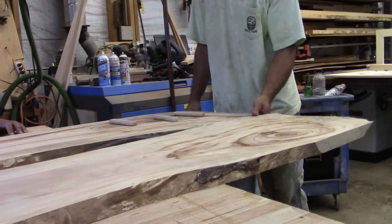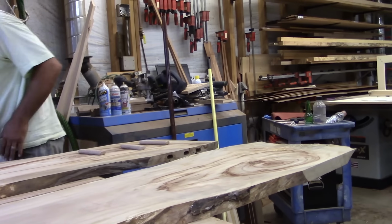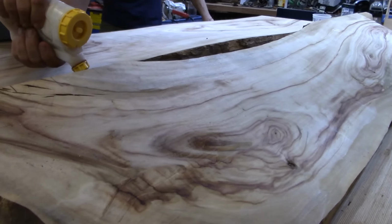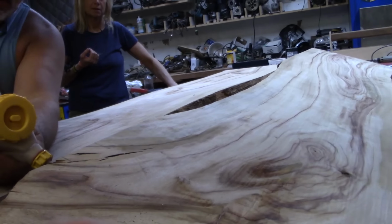Bang them. Yeah, go ahead and glue it together. So what are you going to glue it with? Four clamps. The Titebond 3 is that one right there with the little yellow top on it. You want to feel, these are glue ridges here. You want that, that's what causes it to bite.